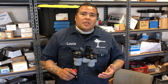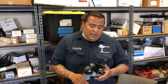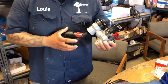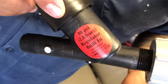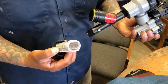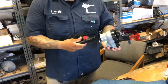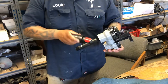The first one is when we're dealing with low flow applications under five gallons per minute. For under five gallons per minute, they do recommend using a special low flow valve made by Rainbird. To go along with that low flow valve is a filter that reduces pressure down to 30 PSI, as well as a pressure regulator and a screen filter that is part of the valve. This part simply screws into your three-quarter inch valve, and from there it would head out to the area that you're going to irrigate.